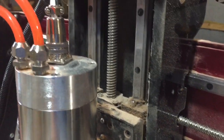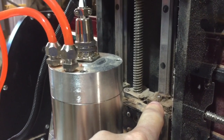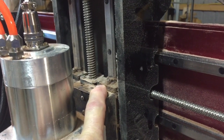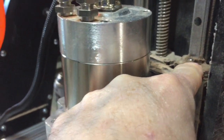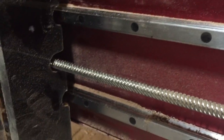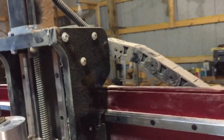If you go much beyond 30 hours, the bearings will seize up. Clean it, grease it, and you can work another 30 to 40 hours. In extremely dusty conditions don't exceed 30 hours; with less dust you can go up to 50 hours. The bearings have wipers, and when they start getting dry, the first sign is that dust begins building up rather than being wiped clean — that's when you stop and re-grease.